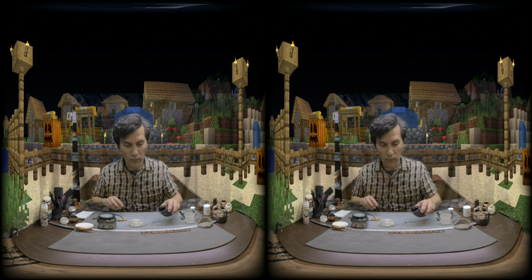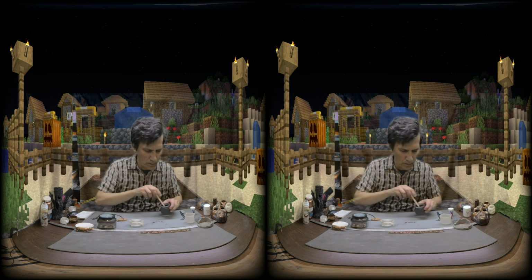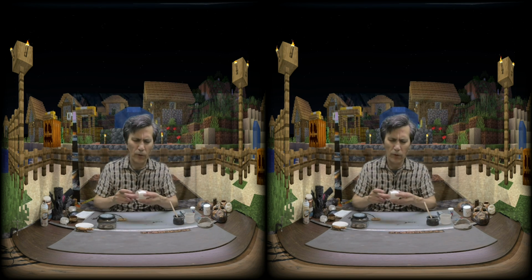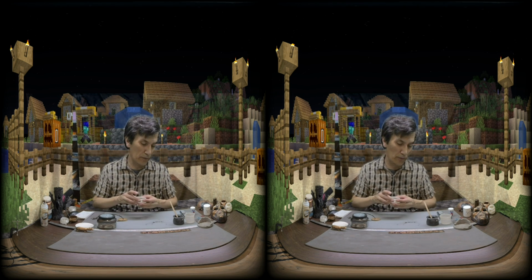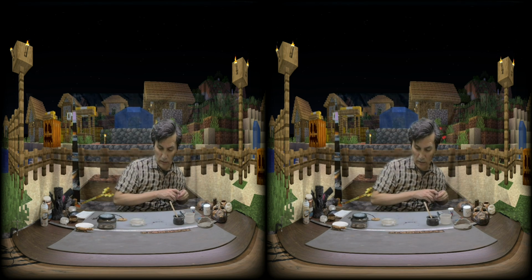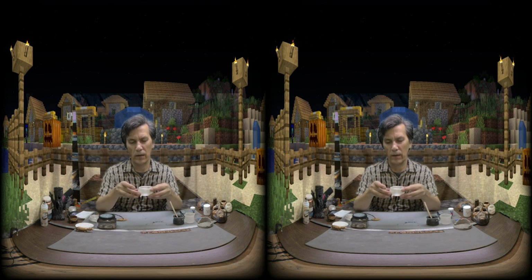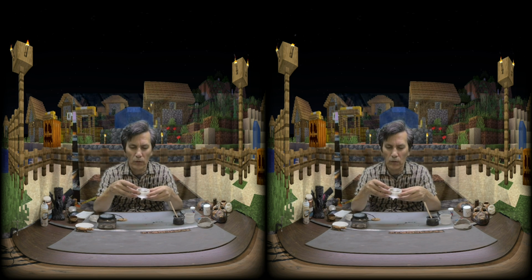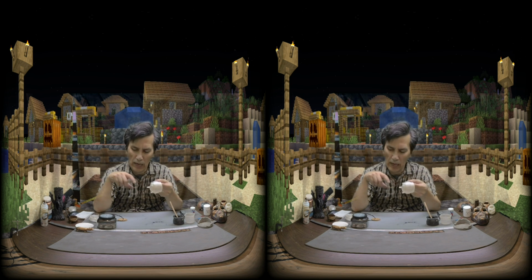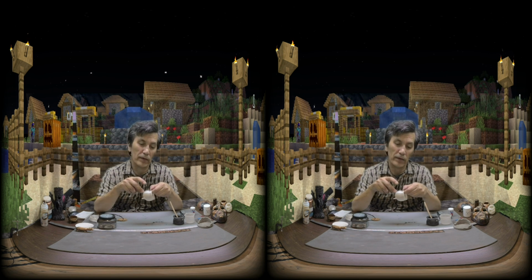Okay, stirring part complete. We have some nice paint here. Look at that. So, next part, we're going to simply cover this with conductive surface, but before you do that, you need to consider where your anchor points are going to be. When you put this in an electroforming tank, which is basically a big vat of acid, you want to, 1, hold the part, and 2, have a wire going to it so the whole process works.